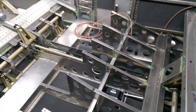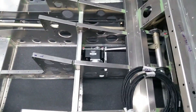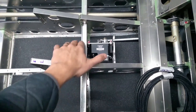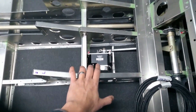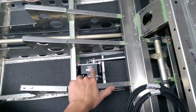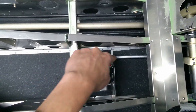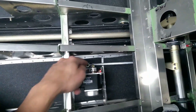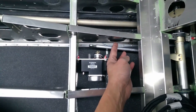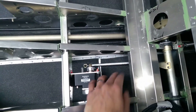Another thing that got done was getting my autopilot servos installed. I did the elevator one first because that's much easier access — four bolts to the brackets that were already on it — and then these guards you have to fit to restrict the movement of it.